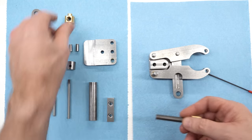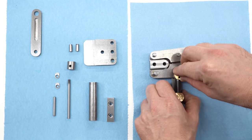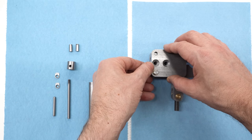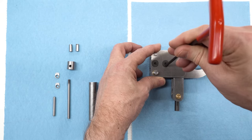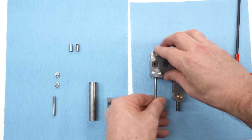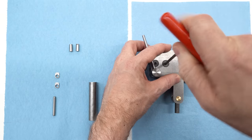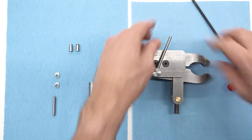Now we can put on the other arm and fit the screw assembly in. You do have to screw the nut onto the screw before you put the screw in place - ask me how I know. The other yoke plate just goes on top with no fasteners - it gets sandwiched between the side plates and that's enough to keep it from coming out. Then the other side plate on and we'll put the screws in loosely. Now these screws, like most that came in the kit, were way too long - I had to find other screws or cut them off shorter with a belt grinder. If you've put one of these together I'd be very interested in hearing if your screws were too long as well. But it all fit together so I don't think I screwed it up.